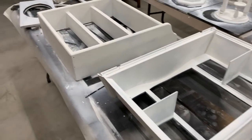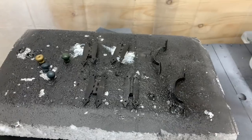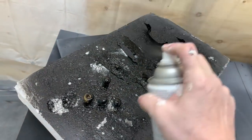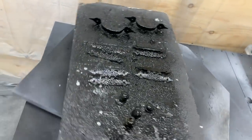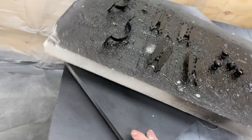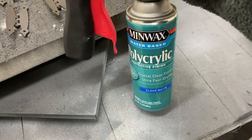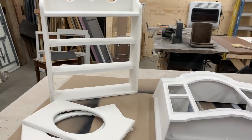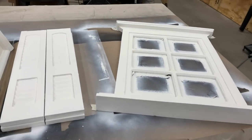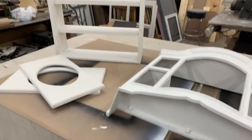At least now all three pieces are painted white. After cleaning my hardware with some Dawn dish soap and hot water and letting them thoroughly dry, I'm taking the Rust-Oleum paint and primer in one in flat black and giving them a nice cleaned-up coat, then finishing with some polycrylic to protect that paint. Now all these pieces finally have all the coats of white they need - everything is completely covered and I can proceed to the next step of sanding.